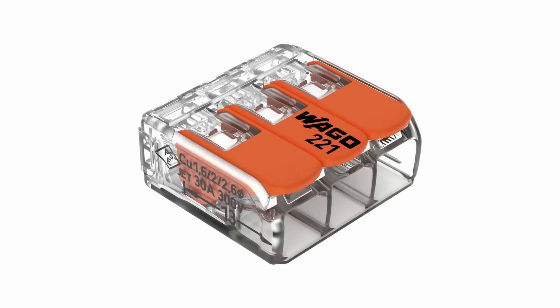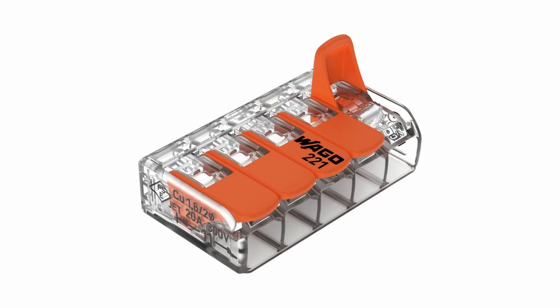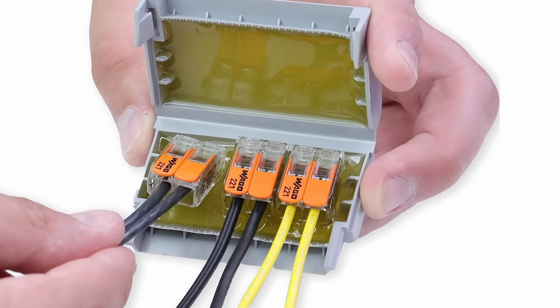Just a note: there's also a small version where you can connect three or more wires together with the WAGO connectors. They actually have a special accessory — a box filled with gel — and if you put that around the connector it's supposedly waterproof. I would not install it underwater, but in case there's any chance of the connection getting wet, it's a really nice piece of kit. Especially if you want to mount navigation lights or something in areas where there might be water dripping down. I've had good experience with that, so check that out.